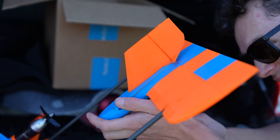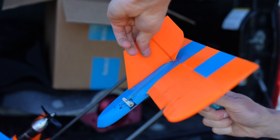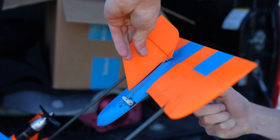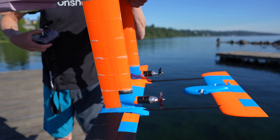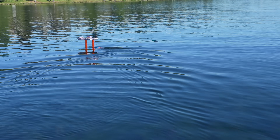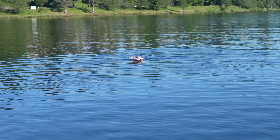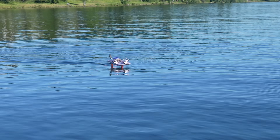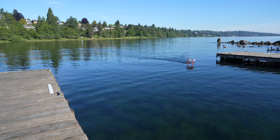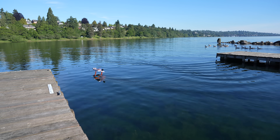There's just one more thing I want to try — removing the vertical stabilizer. I think the differential thrust mapped to the yaw-stabilized PID will be enough to keep yaw stable without a tail fin. With no stabilization, yaw drifts around quite a bit — it's definitely less stable. Now turning on stabilization — it definitely feels more locked in. I would say that's enough yaw stability, so I probably don't need a vertical stabilizer on the real thing.